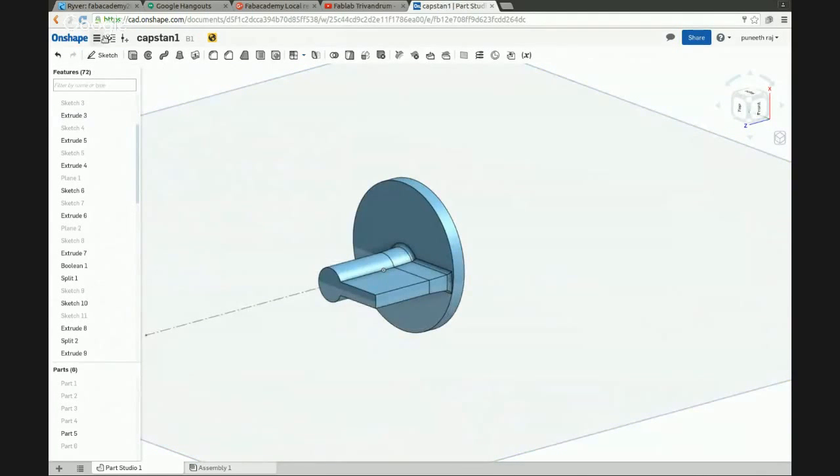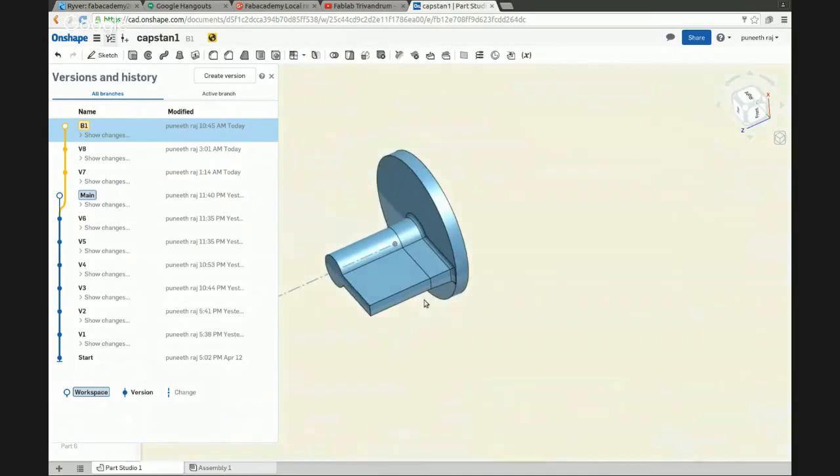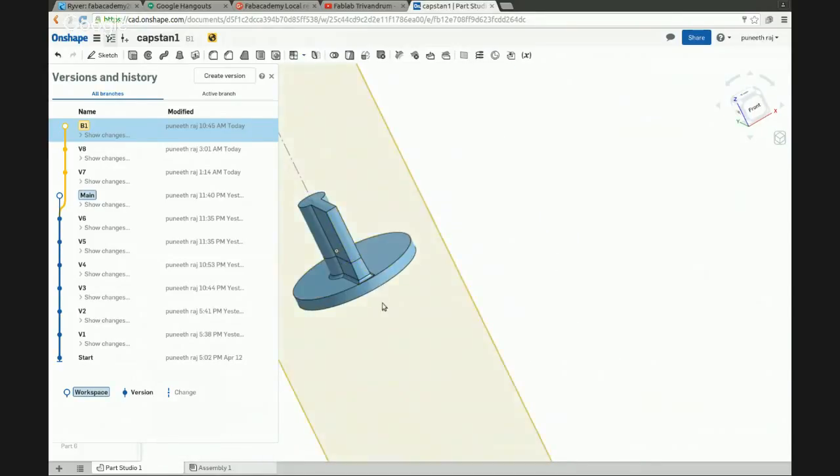You got that? The thing is, I'm going to use polyurethane plastic for this, and I want it to be strong. So what can I do for that? Yes, you can use the Smooth-On plastic for that. I'm concerned about how strong it will get, and this particular part is hard to do in Modela. I want this in silicone. I was wondering how to do this because this is 18 high or something. Either I can use a wax part, which will be hard to remove since polyurethane will set hard on it, or I can try to make a silicone part of this, which is harder to do.